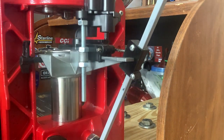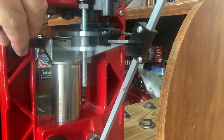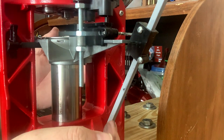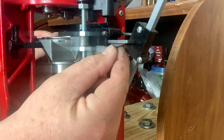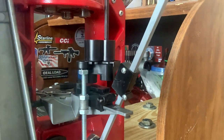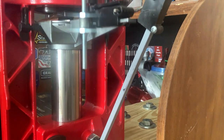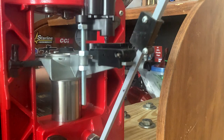So what we're going to do to fix this is move the ram halfway up. You've got a little ledge right here that the indexing rod rides on. We're going to go ahead and pull that out, then grab this right on the end — there's a little ear on the back — and I'm going to move it towards me. You can see here how it has movement; that's what the issue was — the platform got shifted over. So we're going to move it down there. Keep messing with it until you get it going smoothly.